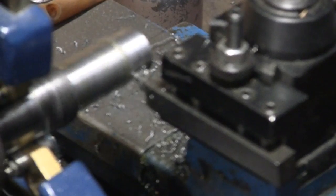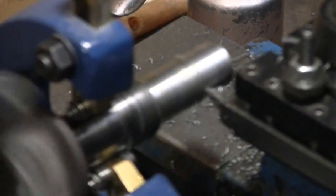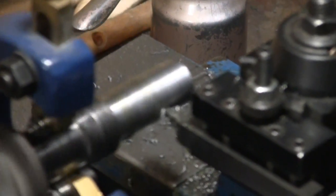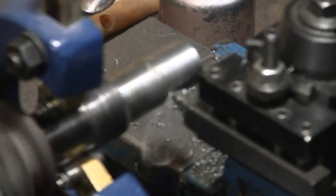You see, some spots of the crank are harder than others. Because again, it is weld built up with a MIG welder, you know. And our heat treating process was a little lacking. But it's cutting pretty fair. Good enough for what we're doing, you know, just a novelty engine.